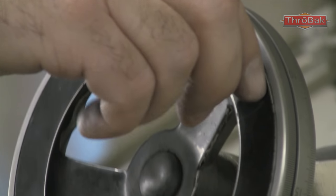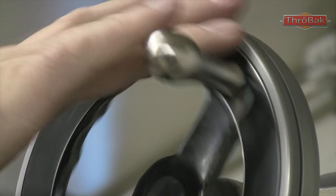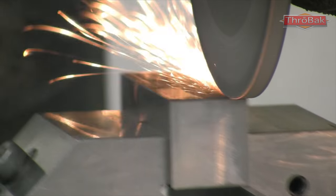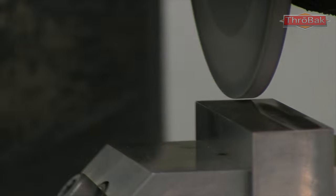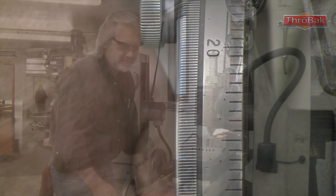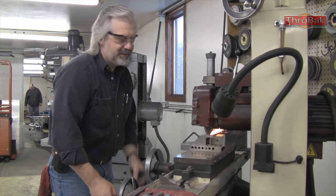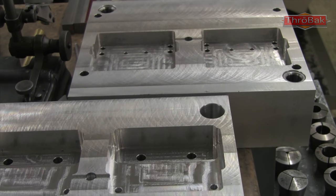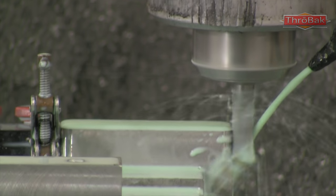I stripped the wire off an old pickup to give him that part. There are four variations of the bobbin because the original mold was a four-chamber mold for PAF bobbins. We chose two of those chambers for the slug and screw coil, so our mold is a two-chamber mold. We picked what we thought was most typically seen as far as the circle and square offset. There's Fred — nice guy. I was at his place maybe three or four days overall just for approving these parts. He did about three revisions of the mold to get the circle-square hole right. He does some of the initial work with CNC.